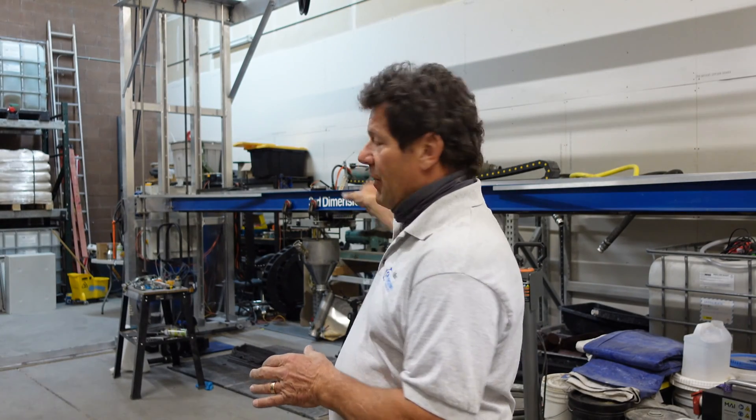We are making printers for different clients. Handling the geopolymer is a little bit different than Portland because it's a different chemistry. Portland binds and glues together through calcium and it's not a really good bond. They heat it up and make it into clinkers to make the Portland concrete. It's only been around for 98 years, under 100 years. With geopolymer, we bind with silica glass and it's a much better bond, but the chemistries are different.